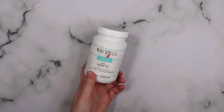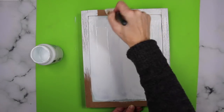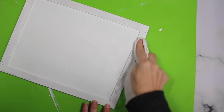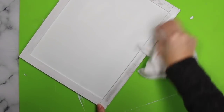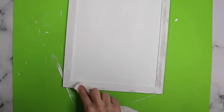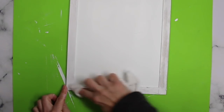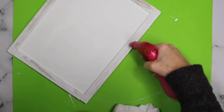After that I painted the sign with Waverly chalk paint in white — this time also painting the frame. I gave it two coats of white paint. Once completely dried I went in and wet distressed the frame to bring back some of that wood grain look and give it more of a whitewashed appearance. Wet distressing means using water instead of sandpaper to pull some of the paint off and expose what is underneath.